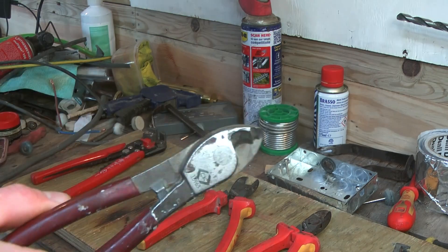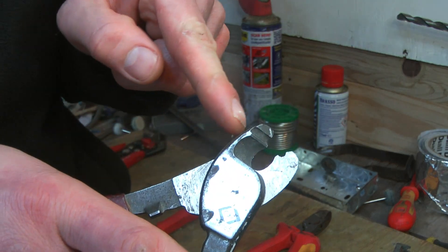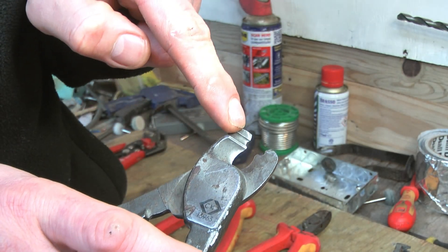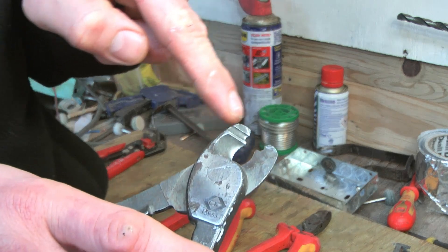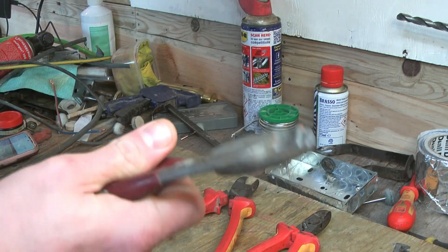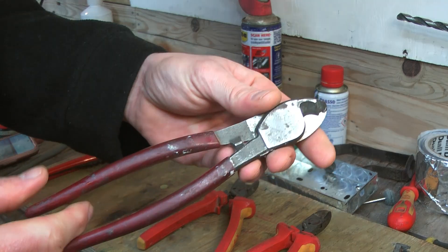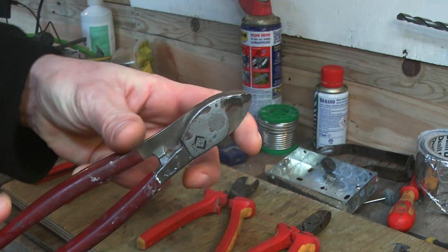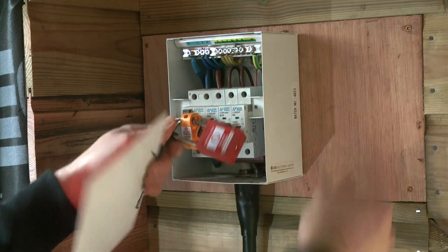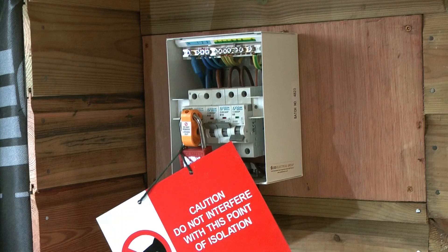While they don't have the neat little wire stripping holes like their side cutter counterparts, they do have two sections which can be used for both stripping and cutting, making removing insulation on larger cables very easy. Since they're built for heavier duty work, if you're working on an industrial site these are your best mate, but maybe not ideal for domestic sparks. Now they're not insulated, so make sure you've done your safe isolation and properly locked off the fuse board — or at the very least, that there aren't any knuckle-dragging painters lurking around trying to kill you.